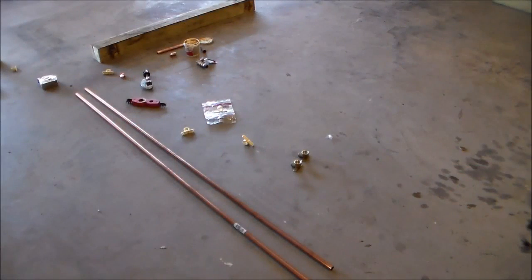I'm also going to install a hose reel that's going to help keep the hose up off the ground and make it easy to pick up. Here are some of the parts I'm going to use: I've got about 12 feet of half-inch copper tubing. I'll use a flexible jumper hose from the compressor to this loop to cool the air down — the copper will dissipate the heat kind of like a radiator.